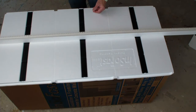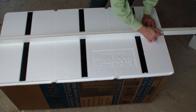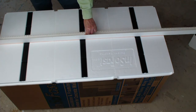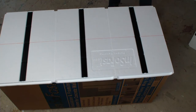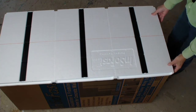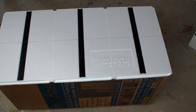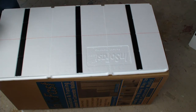I'm going to give it a nice orange line to follow since we're cutting this in half and it'll show up better on camera. Remember, InsoFast is rough framing — it's not fine carpentry or finish work. You are going to be putting drywall or some kind of finish material on it, so don't be too fussy. It's easy to cut, and if you make a mistake don't worry about it — you can glue the panels back together. Now I'm going to turn my mic off to make the cut.